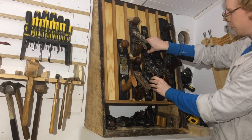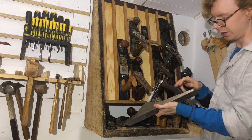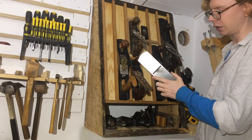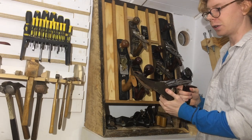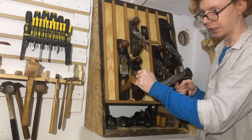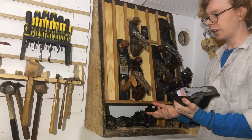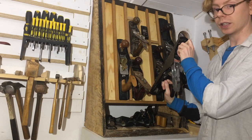This is a British Stanley, same size but slightly newer again. It has router-made roundovers instead of actually being shaped to the hand. I've put a small camber on the blade to make it act a bit like a scrub plane — it's too big to be a proper scrub plane, but a slight camber means I can take shavings across the grain and fairly heavy cuts. It's my main roughing plane and it's good at its job.